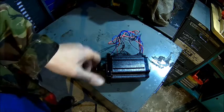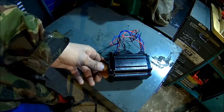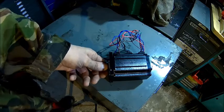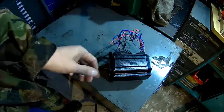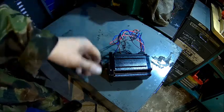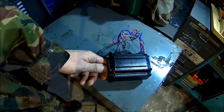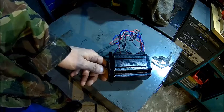A 3 to 1 ratio and that motor would probably be suitable. You could drive the other spindle directly, but for this machine it would be better to reduce speed as well since you only want very tiny movements. For good resolution, you probably want to reduce speed a bit because this motor does 1.8 degrees per step and microstepping can sometimes be a bit critical. Reducing by a factor of 4 or so will also increase your torque. On a milling machine it would be different because you need some speed, but on this sort of machine it wouldn't matter.